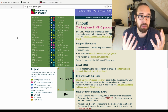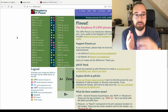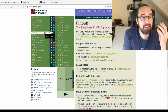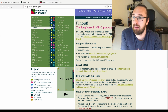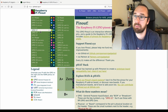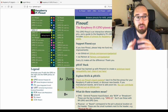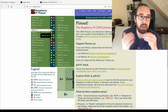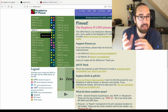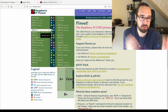And that's basically done in software. So you can tell the Raspberry Pi in software if this pin should be pulled up or down. So that's super, super cool. And you can also tell it that it's an output, and then you can set it to up and down. It's similar to pull ups and pull downs, and it cannot drive a lot of load, but it can drive simple LEDs or any logic. And you could also connect a FET or a transistor to drive larger loads.